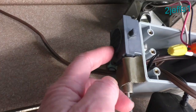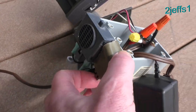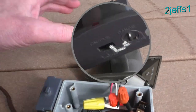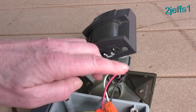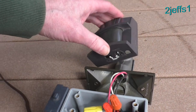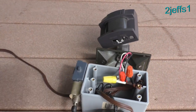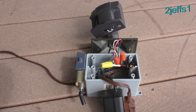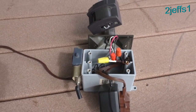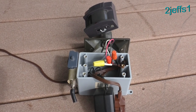Just go to the switch, turn on your key buzzer, and you can see there where you gotta set that. Now, if you're gonna do one of these, check the wiring diagram for the sensor you buy, because sometimes the wire colors can be different. And if you're not real sure about wiring or electrical, maybe best to leave this idea alone. That way you'll be allowed on the planet another day.